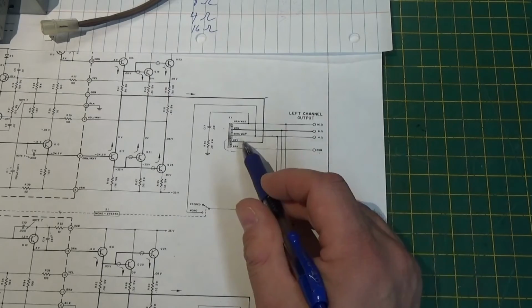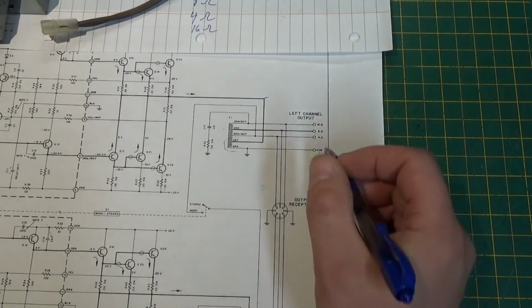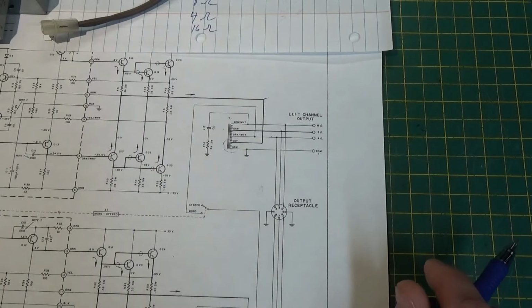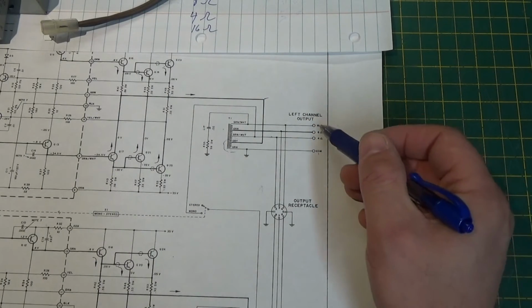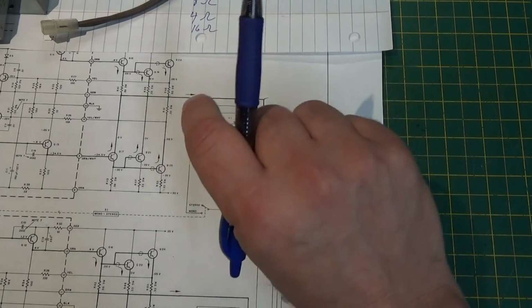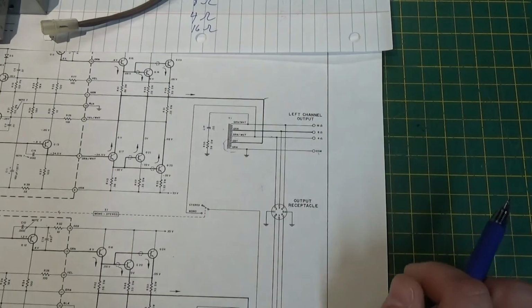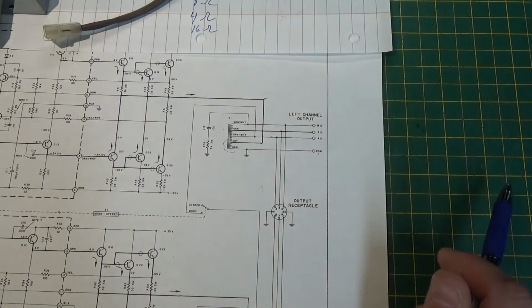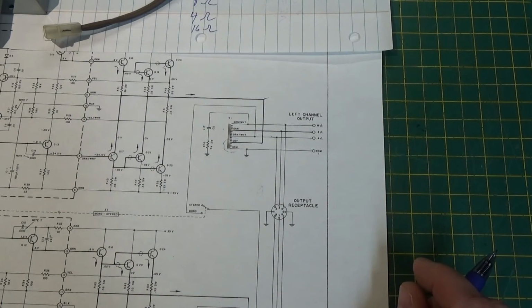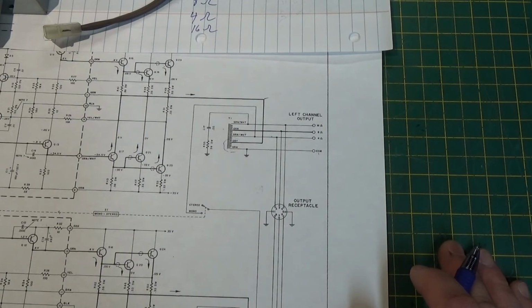If I put the proper speaker on this transformer, I'm going to probably have a pretty linear, across the board amplification factor. And that's what I found out with that P237. I put a 16 ohm load on the 16 ohm tap of that amp, and it just didn't really care what frequency I put in it. If I set that little trimmer pot, the gain pot at the front end, to a ratio of 1 to 10, it pretty much hung in there no matter what input frequency I put in. It was always giving me that same ratio. So it was a very flat, pure reproduction amplifier.